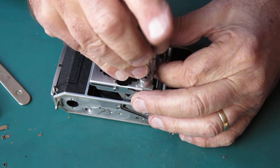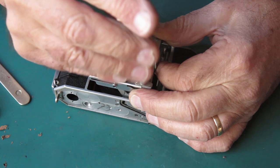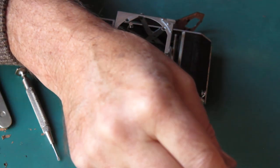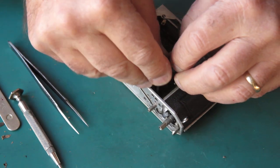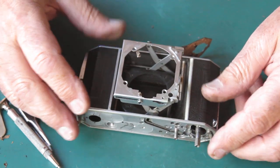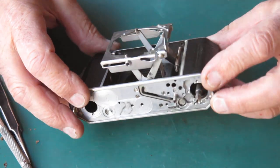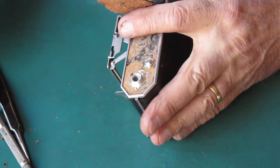This cover I need off the front here — that screw at the top's loose, and that would not have been a good thing. If that rattles about too much, the point at which the shutter cocks can differ slightly, and that inevitably means the shutter might not cock — particularly at the 500th of a second speed which requires more force. If things are not being held firmly, it doesn't move far enough to cock. Okay, that's pretty good. But at the base of the camera here, I want all this film advance stuff out.